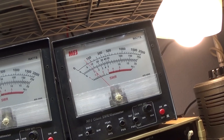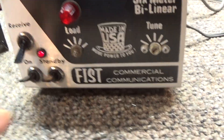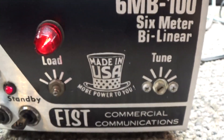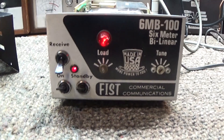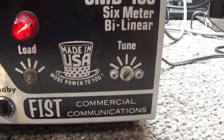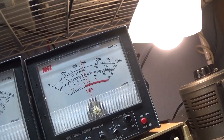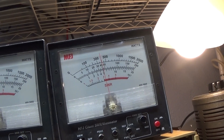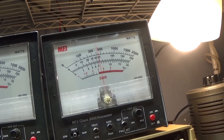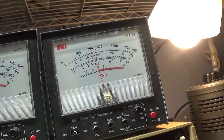That's all it's doing going into this amp. Now we're going to put it on the 200-watt scale on average and turn this little guy off standby to operate and key it down. Notice that it doesn't have any meter on it — it's got a light there for RF. It lights up and the brighter it goes the more watts you're doing. On the 200-watt scale of the wattmeter, with only one and a half watts going in, it's doing 35 watts, talking about 55, and swinging about 70 on average.